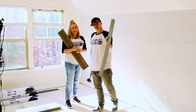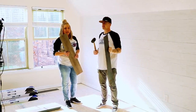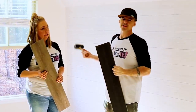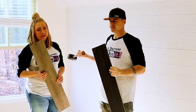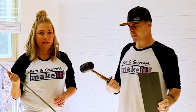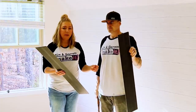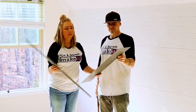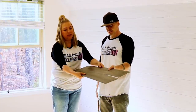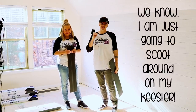Time to lay the flooring down. We're just going to stagger it. This first row I'm going to leave a whole plank; the next row I'll cut six inches off and put 12 inches down; then the next row I'll start with six inches so the seams don't line up. This is just a floating floor — you don't have to put anything underneath, they just lock into each other. Tap it down with a rubber mallet and we're good to go.